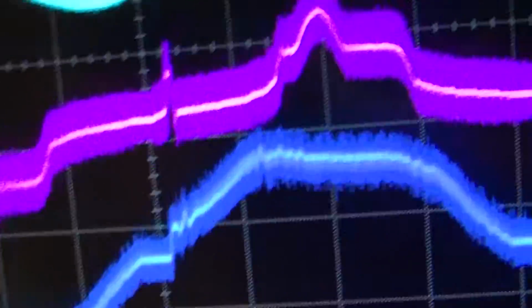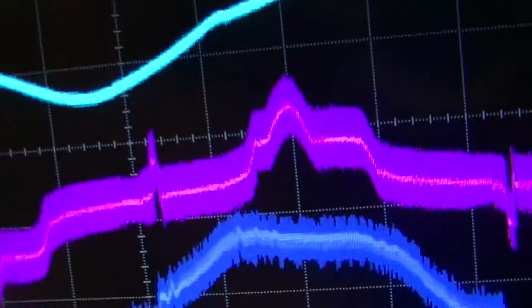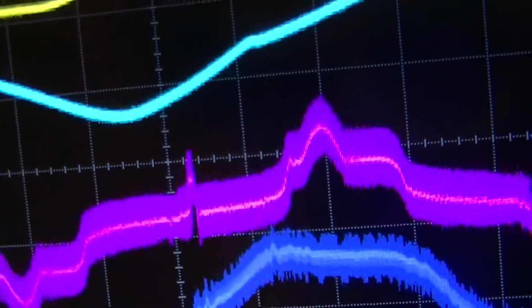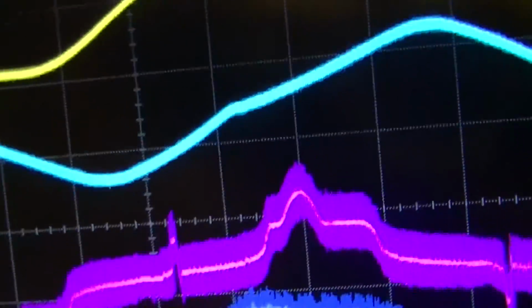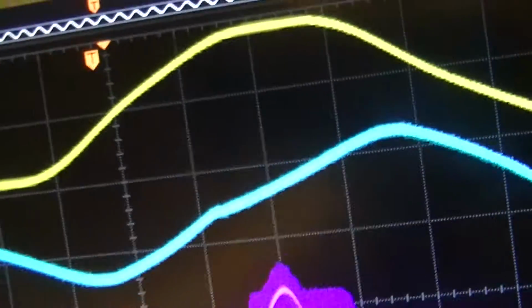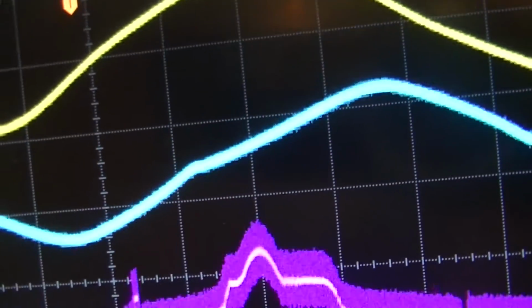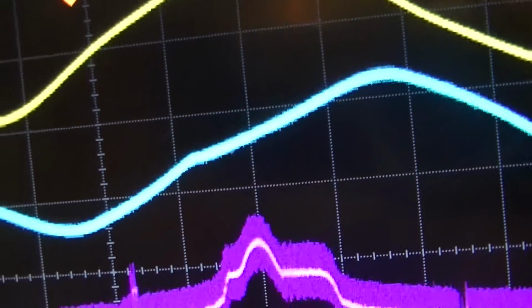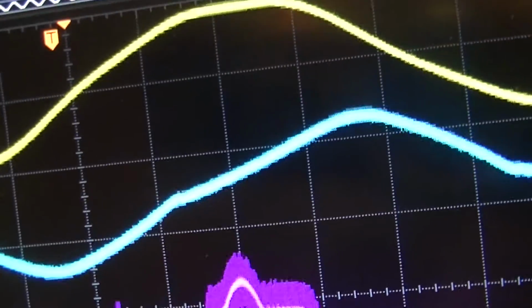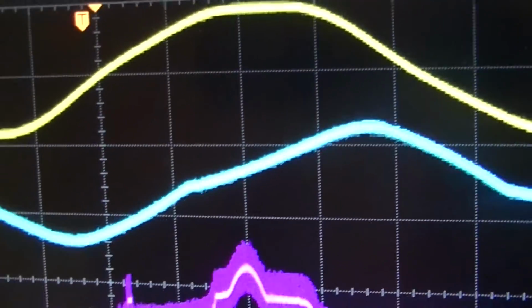So yeah, obviously if you want really clean waveforms, or if you need relatively clean waveforms, the magnetic compacts are the way to go. Of course, they haven't been made in many years, and they're fairly collectible, but there's some company that still makes, I think they're called Enertron, as of a couple years ago when I last checked, they still make magnetic compact fluorescent adapters.